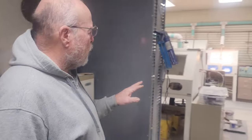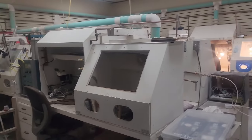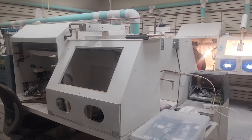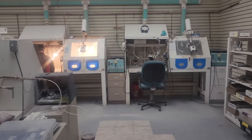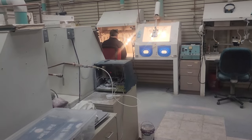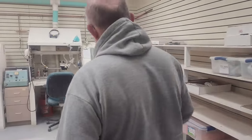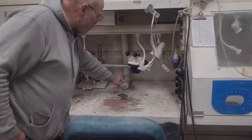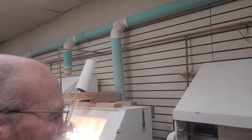Over here is where we do 99% of our work — our prep stations. We use air abrasives to clean stuff, and we've standardized on the SS White units because the parts are similar and we know how to repair them. It takes a very fine powder, almost like talcum powder, through an air system. We have a vibrator which shakes it through baffles and brings the powder into the prep area. The dust collecting is a central system that all goes back to the dust collectors in the utility room.